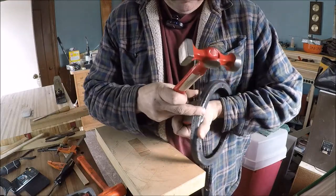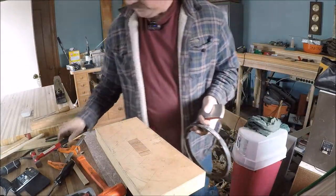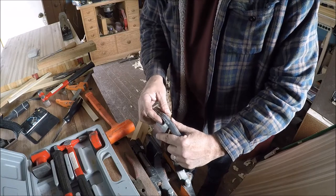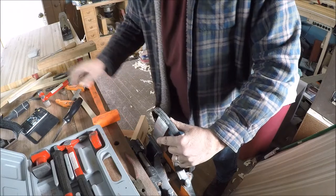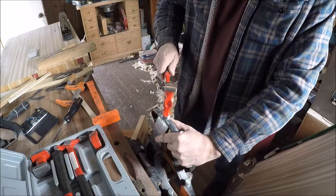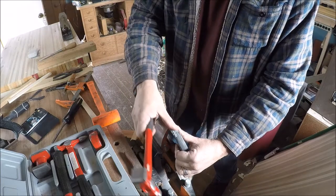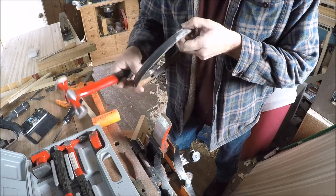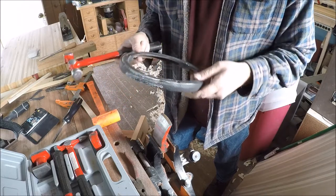Hey, look at that — that moved right in! Maybe I should just put it in my vise and use it like a stake plate. As long as the vise holds it, this works pretty good. Using a metal hammer seems to actually engage in there nicely. I want the metal to go that way, so I'm using kind of a glancing type blow.